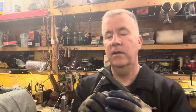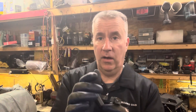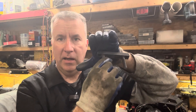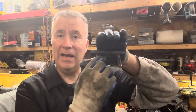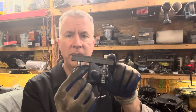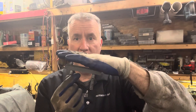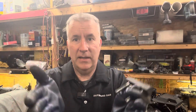Remember the idea behind this. When we have a blind hole cylinder, we can't run our stones all the way through and come out the other side. If I have a cylinder like this and I'm running my stones in there as they're rotating, I can pass through that cylinder and then pass up top evenly, so my stone and my cylinder are going to wear evenly. If it's a blind hole, I have to stop and keep going in and out. What's going to happen is this part of the stone down here is going to wear faster than this part — so we're going to end up with a little angle and a cylinder that has a V in it. We don't want a tapered cylinder; we want a straight cylinder.